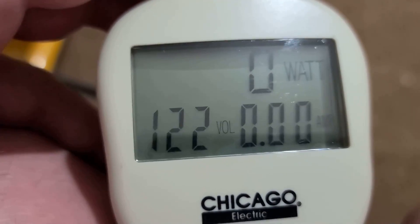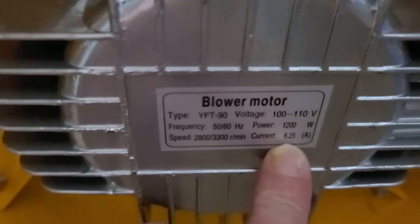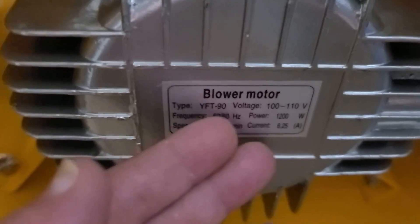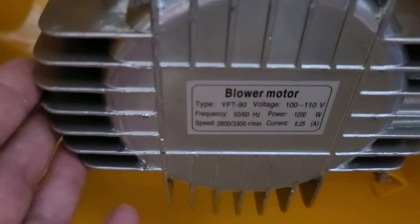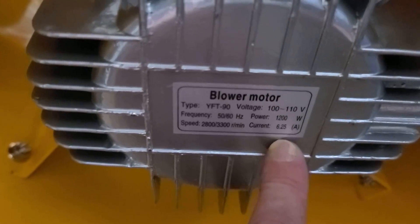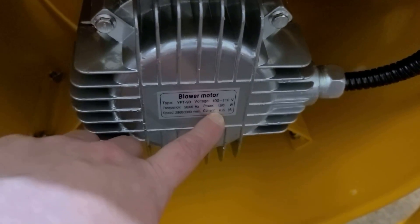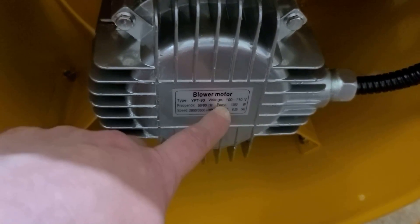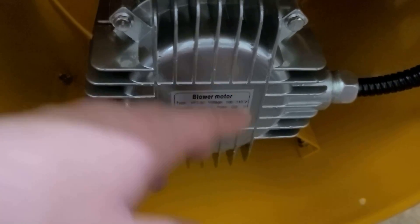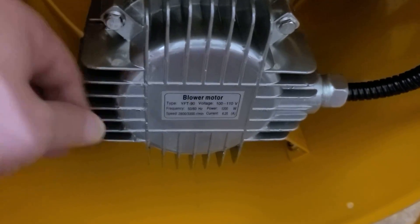It's drawing 1100 watts and 9.6 amps — the motor is unfortunately mislabeled. I suspect the 6.25-amp figure may actually be the 220-volt amperage rating. My measuring unit spiked over on startup current then dropped down to just under 10 amps. That's always disappointing when there's such an oversight. The 1200-watt figure might be accurate at around 125 volts maximum, but you'd think they'd measure and label these things a little better.